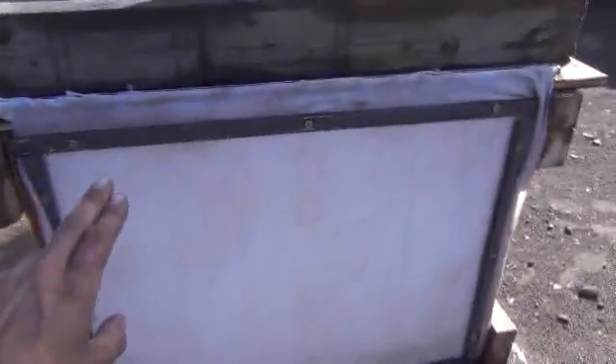It's really simple to build. As you can see, like the last one, all I've really done is build a wooden frame that goes up over the top, down the side, and around the bottom. The rest of it is just window screens. On the back side it's just a stainless steel window screen, and I used other material to hold that cloth nice and tight on top of it. I left the screen in there — that stainless steel, once getting cold inside the box, will actually help radiate some of that cool back into the box. Basically you just have a wooden box with no side walls on the two biggest sides, covered with good cotton cloth — a refrigeration system that'll drop you down into the 60s with no power needed.